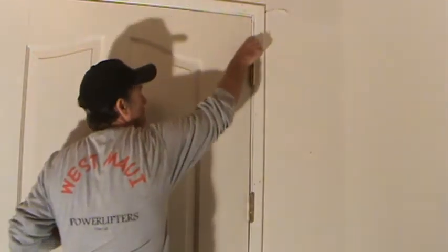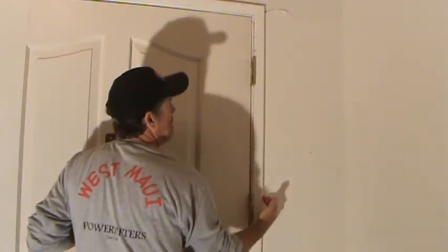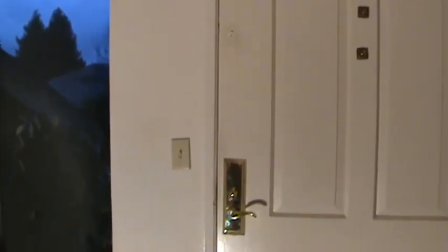I've got the door casing all attached now. See that top left-hand edge — it's down just a hair, there's a shadow line up there too, but I split the difference and reattached it. The only thing I still have to do is caulk it — I'll take the caulk gun and caulk all the way around with white, and also do a thin bead on the outside edge. There are a couple of spots up high where the wall had cracked from settling — you can see those cracks right up in there and on both sides.